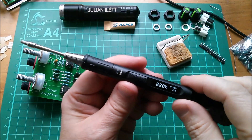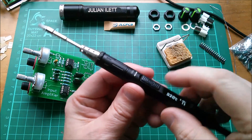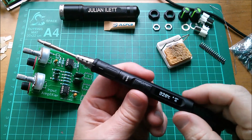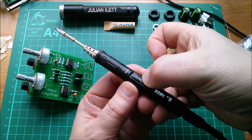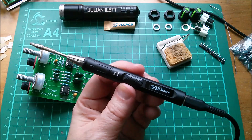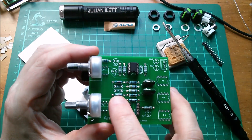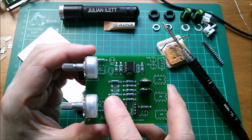Just a quickie on the TS-100: you switch it off by pressing both buttons. But on the TS-80 it's kind of levered so you can't do that — you switch the TS-80 off by pressing and holding the top button and it goes back to standby. Right, capacitors 2n2 — that means 2.2 nanofarads, so that's 2200 picofarads.